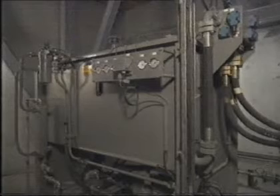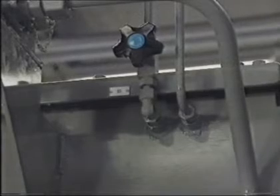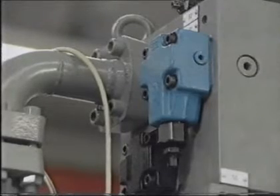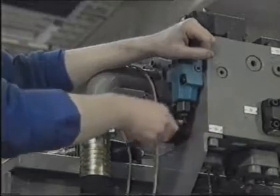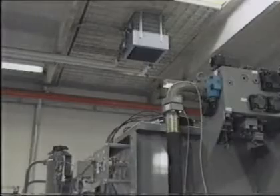The pre-charge pressure, or gas pressure in the accumulators, can be read on gas manometer 105. The gas pressure can only be adjusted when the hydraulic system is in a no-load status. This no-load situation is achieved by opening valve 65. This diagram of an accumulator shows the rubber internal bladder, which is normally only a few centimetres above the bottom valve. Valve 61 ensures a minimum oil pressure, which keeps the gas bladder away from the valve at the bottom of the vessel. If the bladder repeatedly hammers against this bottom valve, it will be damaged, removing the dampening effect. Adjustment of valve 61 must be done with the grinding rollers at rest. The pressure at valve 61 is shown by manometer 42. Clockwise rotation increases pressure, and the opposite reduces pressure.